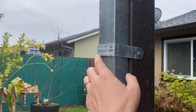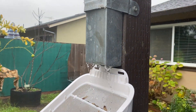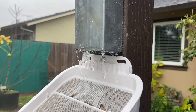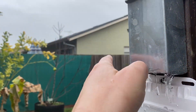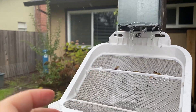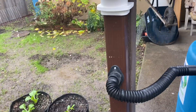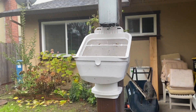Here's a trick that gets a lot of people. This is the downspout that was on our house originally — it's a metal downspout called a two by three inch, but that's a nominal measurement. In reality it's more like one and three-quarters by two and three-quarters inches. The diverter will go in but it crimps a little bit, which does interfere with collection efficiency slightly.